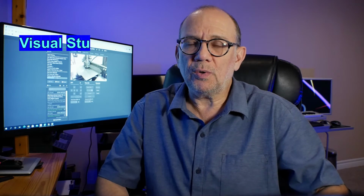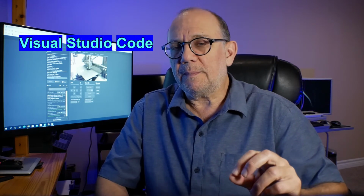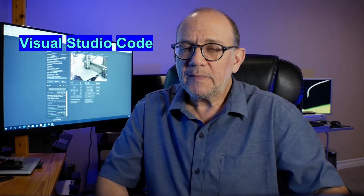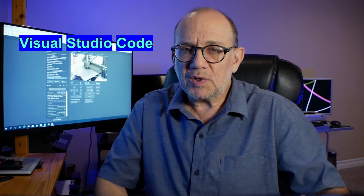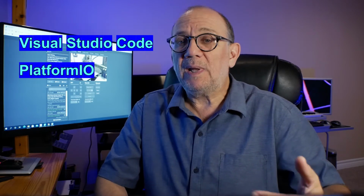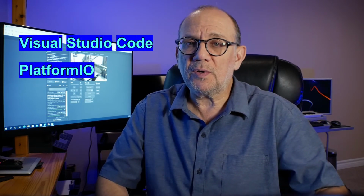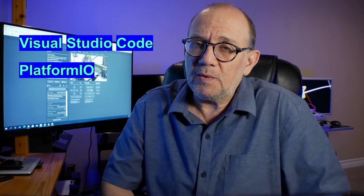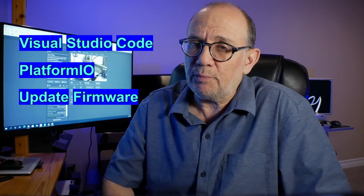Welcome back. In order to activate the mesh bed leveling on your printer, you will need three things. Number one, you'll need to install Visual Studio Code on your computer. Number two, once you've got Visual Studio Code installed, you will need to install the PlatformIO plugin into Visual Studio Code. And number three, you'll need the ability to update the firmware on your 3D printer.